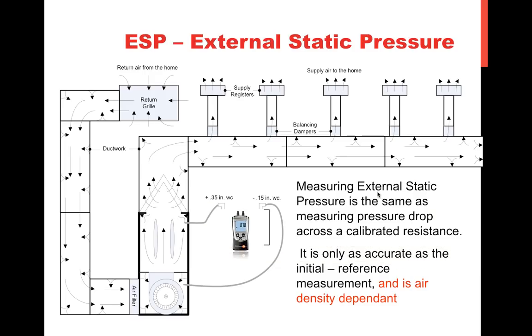Here's an idea of what a more complex system would look like. You do have to have this calibrated resistance, and it's measured at the system or at the unit. It's not something that's measured at the supply or return registers. And this static pressure, again, these pressure arrows that are pointing kind of perpendicular to the flow, that's what's inflating